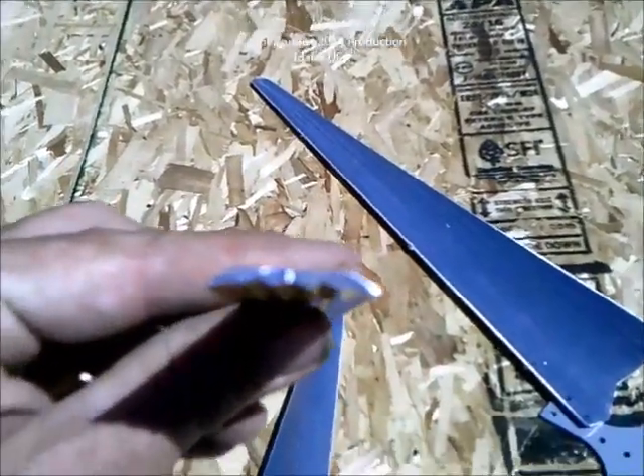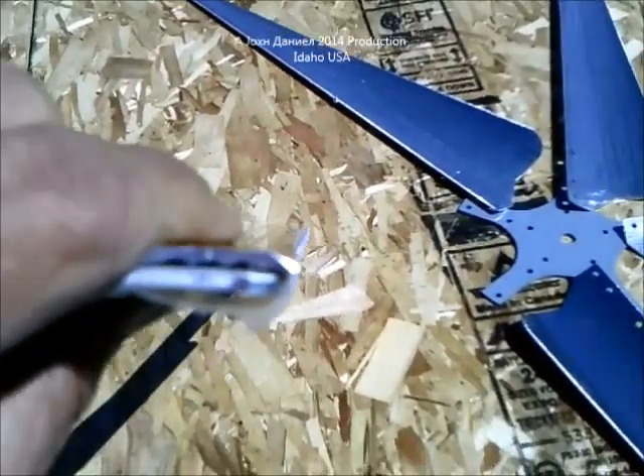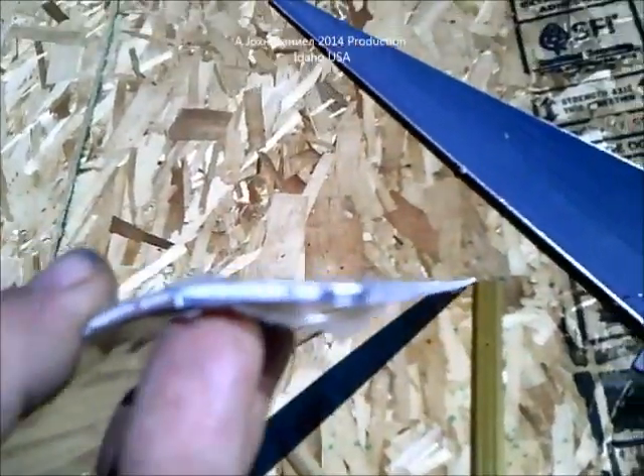These blades are not designed to have low pressure on the back of the blades, so this is more the fan style. What I've got here is a piece of door channel trim, and it's shaped like a little airplane wing. By placing this long ways on the whole length of the back of the blade, you will end up with a pressure ridge on the back of the blade - the whole length. It just goes on with an adhesive and rivets. This gives it three-sixteenths of an inch of a low pressure wing on the back of the blade, and additionally it'll give a little more stiffness to the blade.